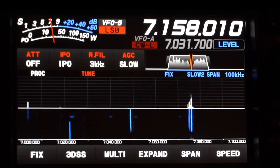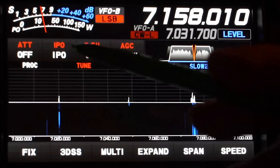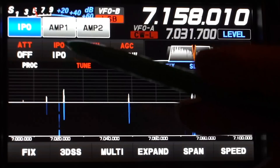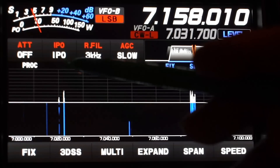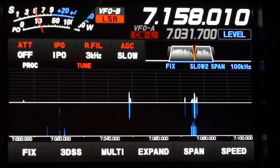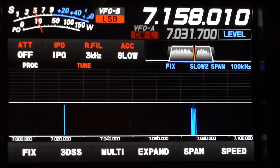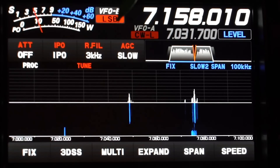A couple of things I want to point out that I find quite interesting. There's something here called IPO. You press it and you've got a choice of IPO, amp one, and amp two. When you switch IPO on, the signal path goes straight to the mixer, bypassing the RF amplifier completely. The theory is that gives you a cleaner sounding signal on the LF bands. Listening on 80 metres, I did find that a significant improvement, particularly at night — switching IPO on made a significant difference.